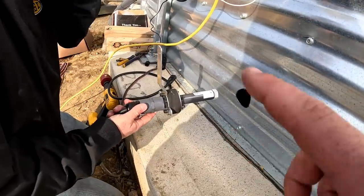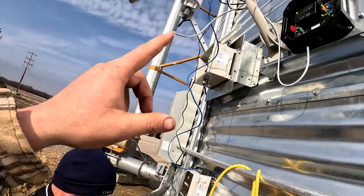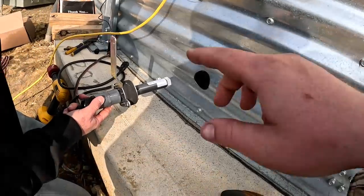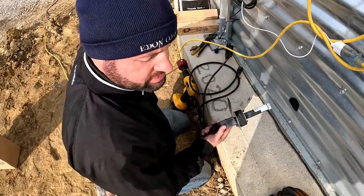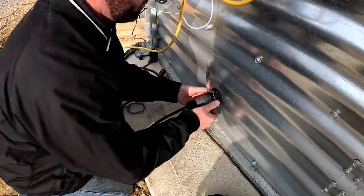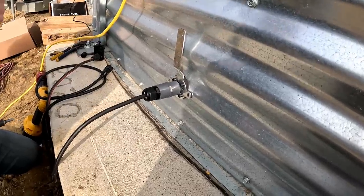What Clint's installing now is the plenum sensor. The reason for the plenum sensor is not just to detect heat from a dryer — they want to know the actual air being blown into the bin. As air gets compressed and pushed in underneath the false floor, they want to know the quality of the air being pushed up through the grain. They also read static pressure so they know the airflow while the fans are running, ensuring good airflow through the grain mass at all times. It hole-saws into the side of the bin with a rubber washer that tightens down like a boat plug.